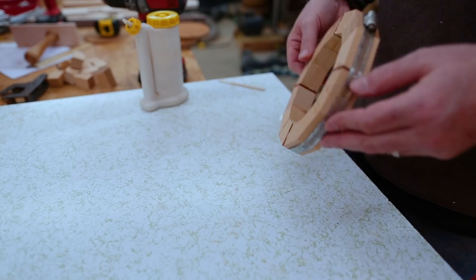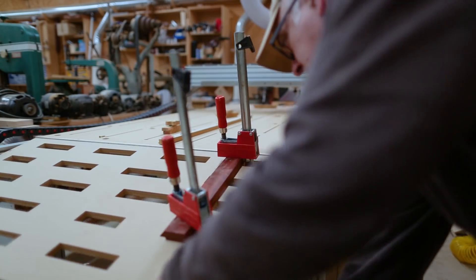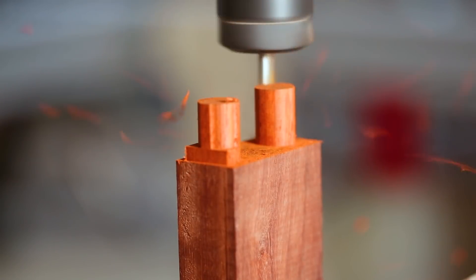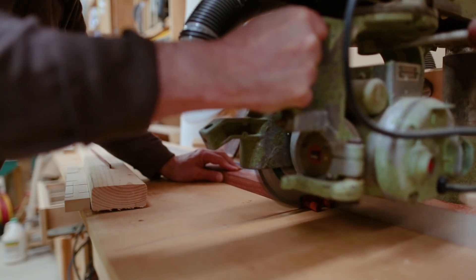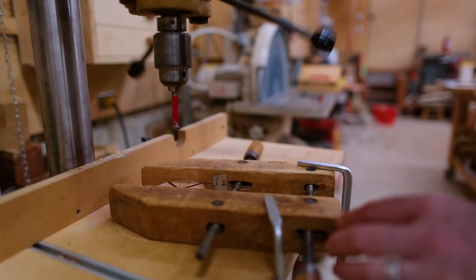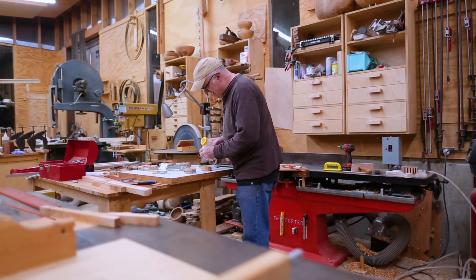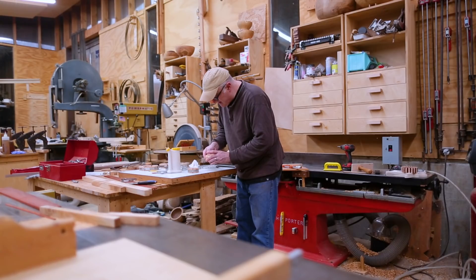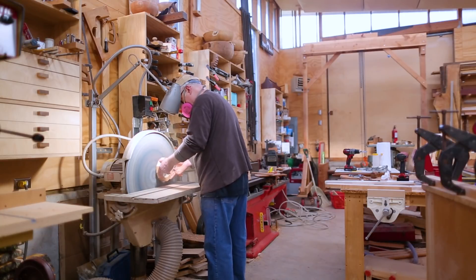I can clamp everything together with a band clamp. The two rings at each end have to be solid in the center, and I didn't quite get all the points perfect on the center of those rings, so I made two plugs to go into them. I used my new vertical table on the CNC machine to cut those plugs to fit into the hole made by my half-inch drill bit, so I can drill out the hole for the rings on the drill press — that's a lot easier than mounting the small ring on the CNC table. Then I can glue the plugs in place.